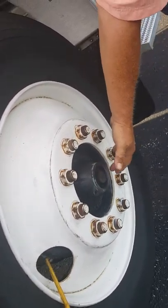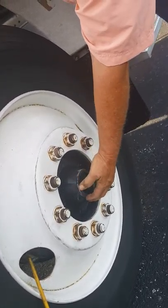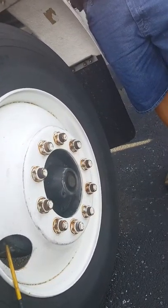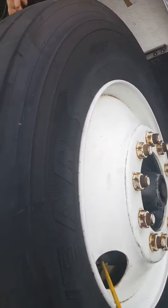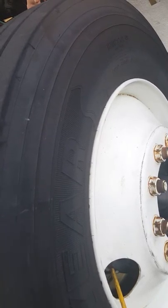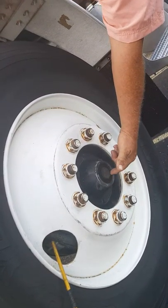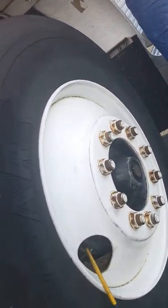My hub oil seal — all my mounting bolts are present and tight, I don't see any leakage out of my hub seal, and I have an adequate amount of oil in my hub seal. You can see the level through the sight glass right there, but I do not want you pulling these caps out because they get brittle.